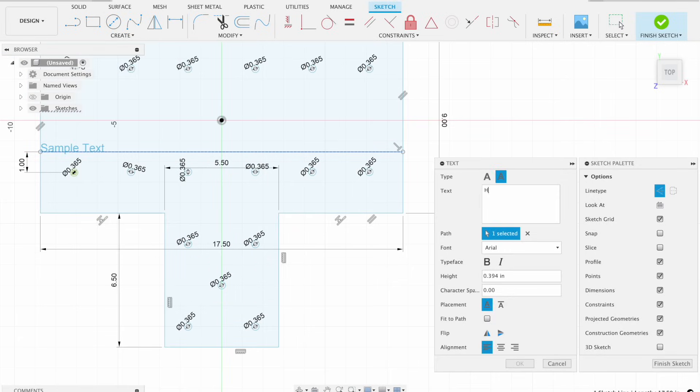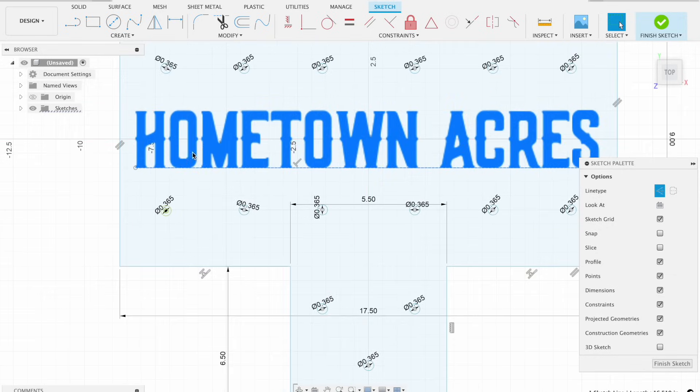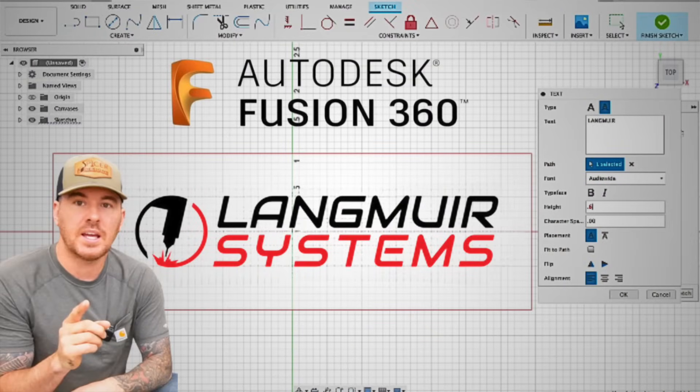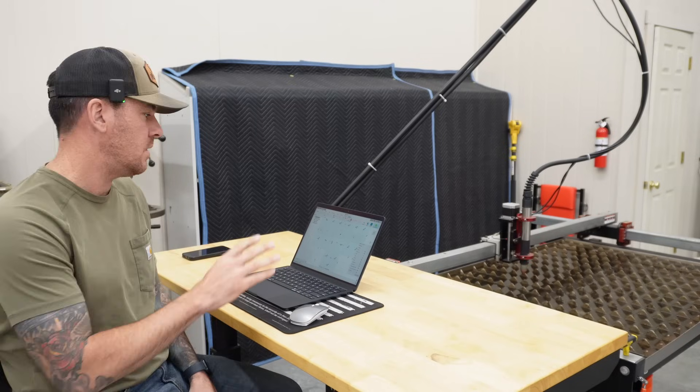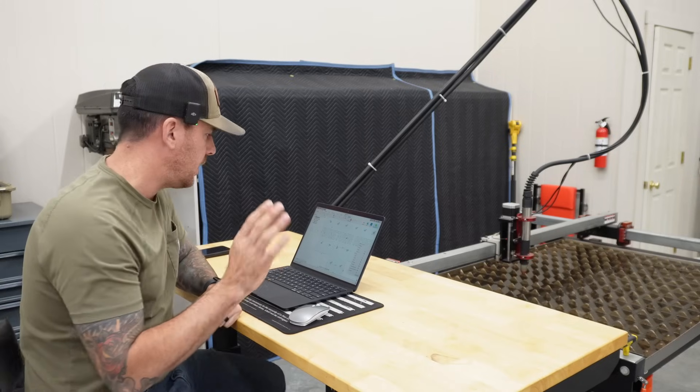'Hometown Acres.' We'll hit center and select — I believe he uses Old Scotch font. I still have it in here. We're going to try bumping the size up. Nope, that doesn't fit — we're just going to eye this thing. It's not really a big deal, it's just for Adam. We're going to put those little center notches right on the center line of the upper section of the bracket. That looks good. Now I'm going to right-click and hit 'Explode Text.' Now we have actual vector lines for that font. I did make a separate video on finding custom fonts — I explain all that if you want more information. I'll have to go back on some letters and add little bridges. I'll do that off camera.